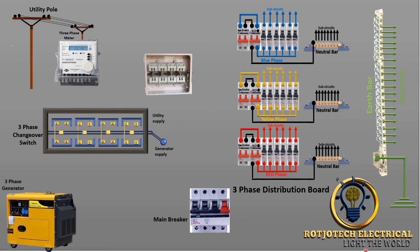Let's start the connection. First, we are going to connect all the 3-phase to the 3-phase meter, and the output of this meter will go to the changeover switch. Red phase to the meter, and the output goes straight to the changeover switch. Yellow phase to the meter, and the output also goes to another separate side of the changeover switch.